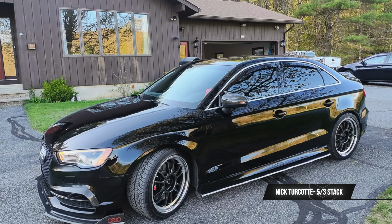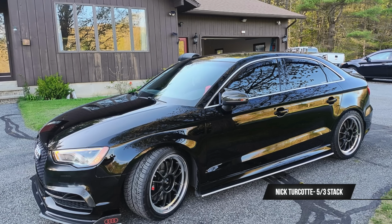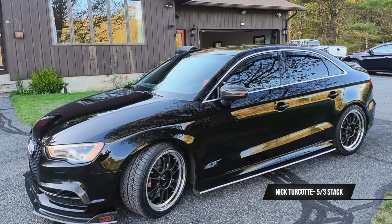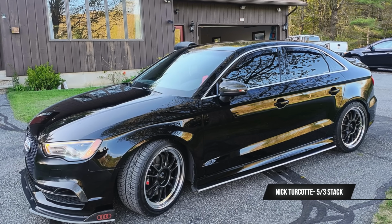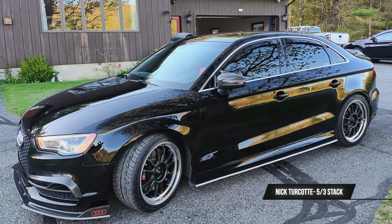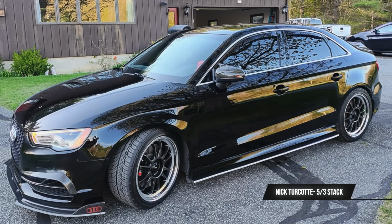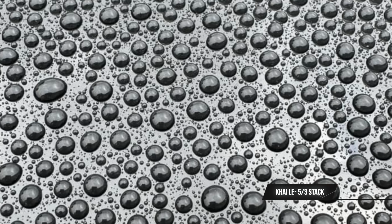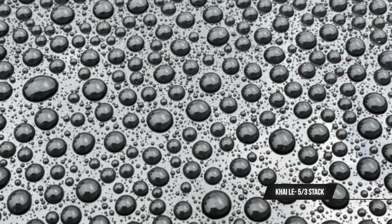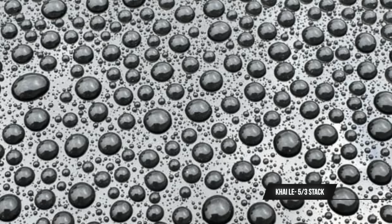But what's happening with the 5-3 or 8-3 stack, and the reason we have that 2 to 8 hour window, and that window is very important. 2 hours is enough for the base coating, so the 8 or the 5, to have set up enough that you're not going to remove it. But the surface is still open. The surface is still malleable, if I can put it that way. Then when we put the 3-year into it, not on top of it, we're putting it on top, but it's actually going into that coating. And it's combining to do some really interesting things.